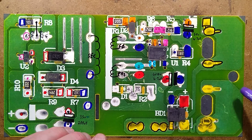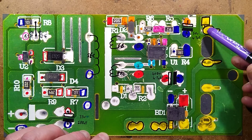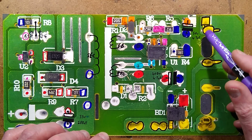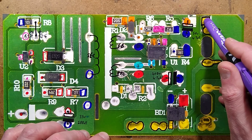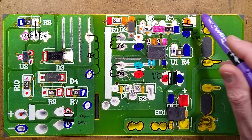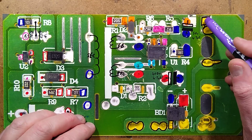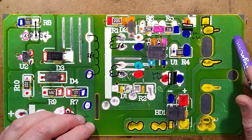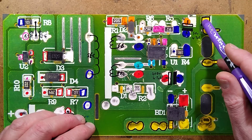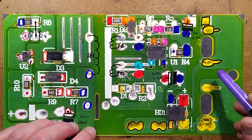This is a universal design — the circuit board is designed to slot into different cases, so it has multiple positions for the main screen. There's also an odd resistor position that's not occupied, which goes to the bootstrap circuit. I did see a 'diode gone wild' video where a bootstrap resistor was from the primary side before the bridge rectifier — I wonder if that's what they were trying to do. But it's not a good idea, though the bootstrap does work, because it had to work when I was testing it.